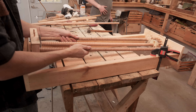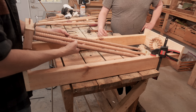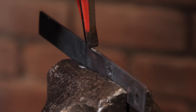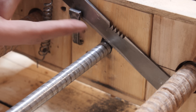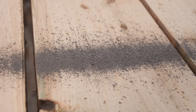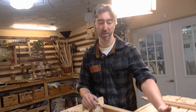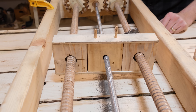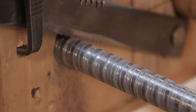I also changed the takedown of the machine itself. Now to take it down, you start by taking out the crank on the outside, and that allows the entire guts of the machine to slide out and be replaced with whatever parts you need. We also worked on the cutting tool — we flipped it over and changed the saw teeth on the outside to file teeth on the inside, and did our best to harden them so they can cut metal. As you can see from the iron shavings, it does a pretty good job. The carriage itself has also been replaced and reinforced to be a lot more robust and handle a lot more cranking force.